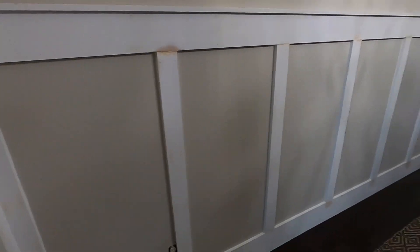The walls and all the trim — I was actually going to spray it, but I figured it's not that much work to do all this with a little roller. To spray it I would have to tape the whole house, so it's a huge mess. I think the roller will be pretty fast. I ended up picking — usually I do flat, but for the paneling I ended up getting an eggshell. It will give it a little bit of shine, not too much. Also, I didn't pick up trim white because I think it's too white — I ended up doing Swiss Coffee from Behr at Home Depot. So let's get this painted and I'll show you the finished product.